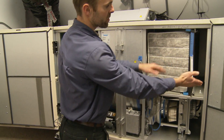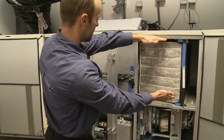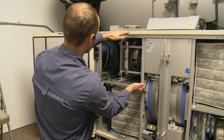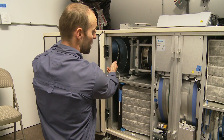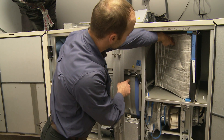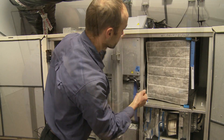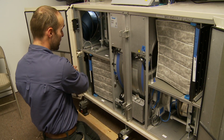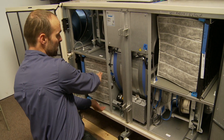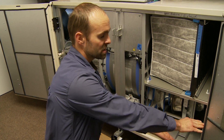Starting right here, this is where the return air — the stale air from the building — comes in. These are some filters, but the airstream goes right through this part of the HRV and this is where it exits out the building — this is the exhaust. Right here there's a rotary type heat exchanger, and we're protecting that from a buildup of dust and dirt by using these filters. This section brings in fresh cold air from outside, goes through another set of filters, picks up the heat recovered from the outgoing airstream, and then sends it into the building.